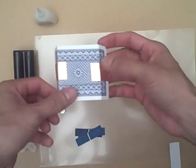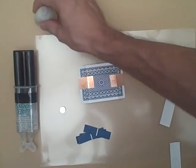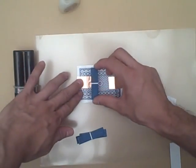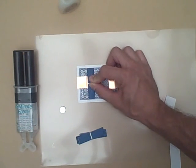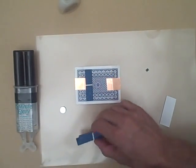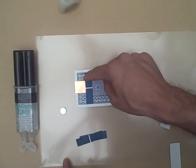So it should look something like this. The next step is to put on your first solette. These are small pieces of silicon PV that have been laser cut out of a larger cell. I put on a little bit of super glue onto my copper tape, and I'm going to press and hold a solette onto the copper tape. I'm going to repeat this four times, connecting the bottom of one solette to the top of another solette.